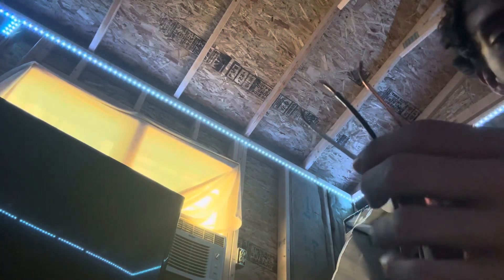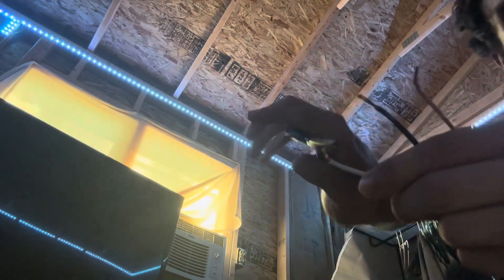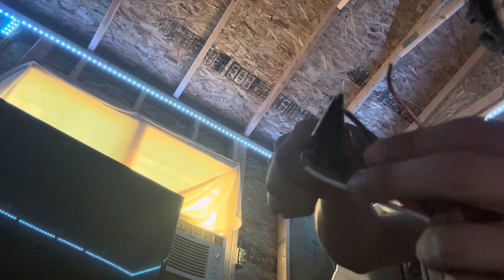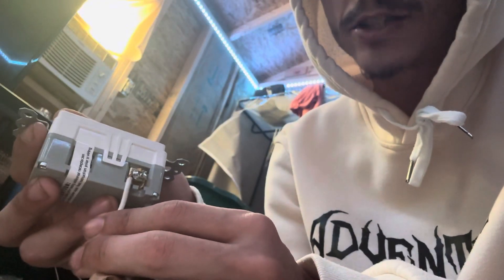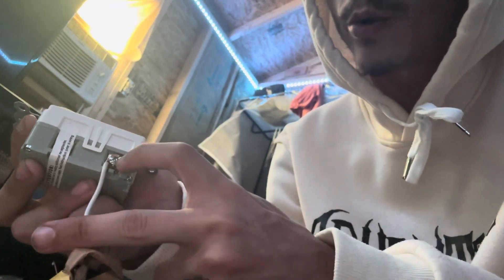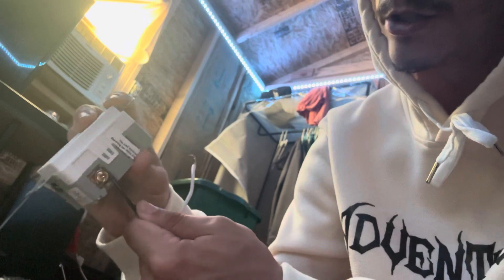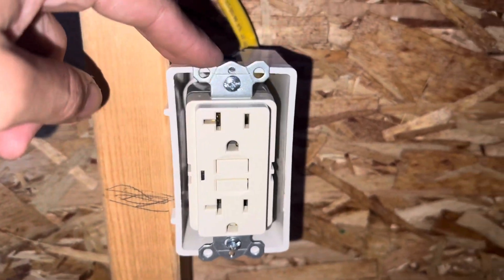Now that you have your wires stripped, take your pliers, grab the wire with the very point of your pliers, and just kind of make a hook. That hook will go on the silver screw on your outlet terminal — same with your power and same with your ground. When you put these on the outlet, try to remember righty-tighty, lefty-loosey. You want to hook it so that when you twist it to the right to lock it down, it feeds the wire deeper into the screw rather than pushing it back out. Each one just hooks onto its own screw, and the bare copper wire goes on the green screw. There it is, all secured in the box — the wires are tucked away nice and safe.